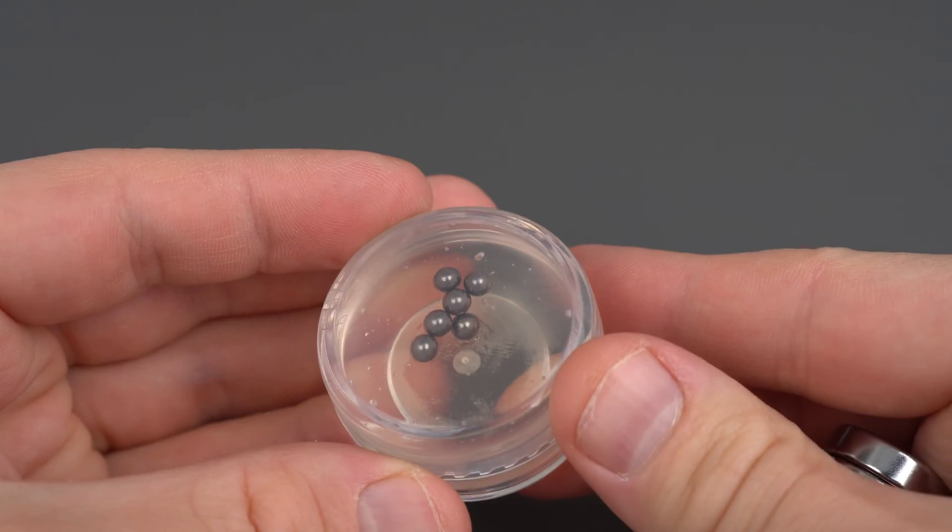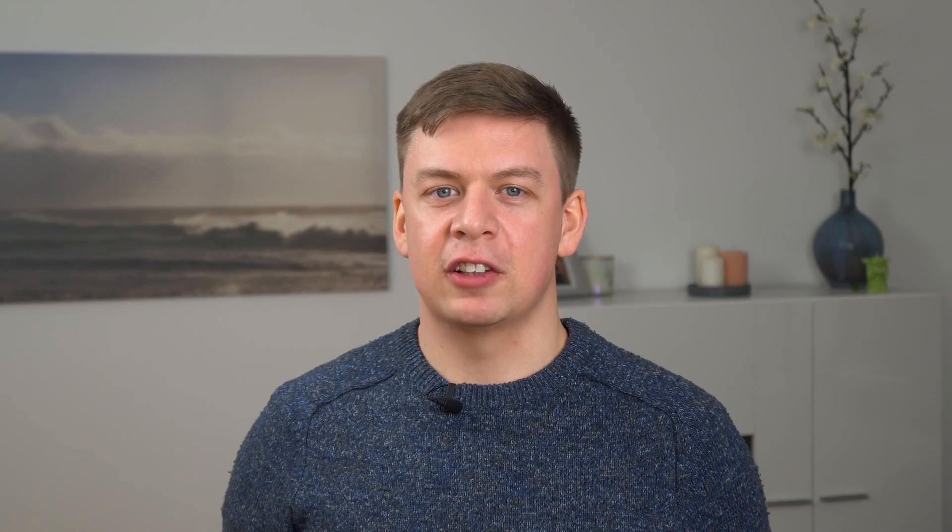But there's more behind the technology than what I've shown so far. There are limitations to what e-ink displays are capable of, such as the effect temperature has, their ability to show colors, and their time to update. I mentioned that I left this pot of rice syrup in the fridge to increase the viscosity, and temperature affects e-ink in the same way. They generally work from around minus 10 or 0 degrees C up to 50 or 60 degrees C depending on the display, but the time to update is much slower at the colder end of the spectrum, and if the display exceeds its temperature limits it can cause lasting damage.